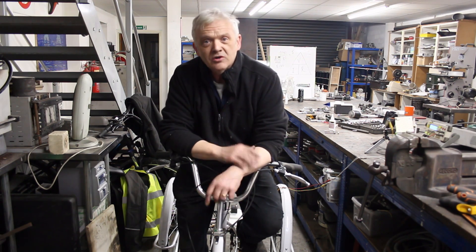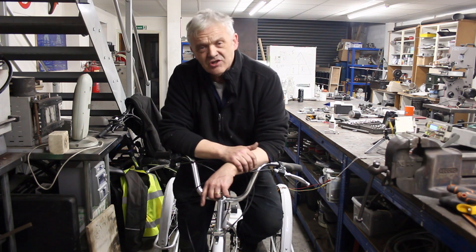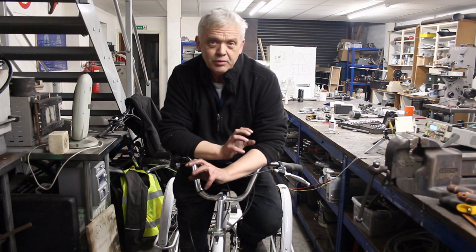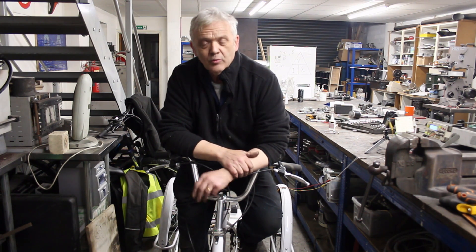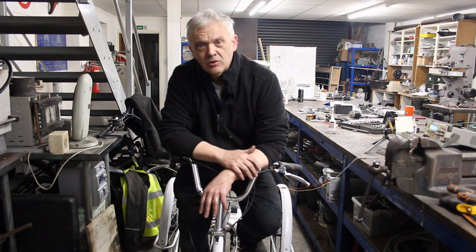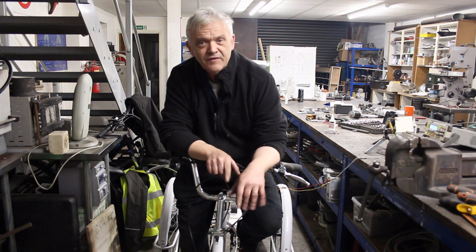You don't have to damage the bicycle to do it. We set it on a frame, put in an auxiliary chain, attached that to a gearbox and motor, and just lashed those onto the bicycle. Put in the effort, pedal away until you've got what you want, then remove everything and you've got a perfectly normal working cycle. You could use the same principle as a dynamo on the tire, but that won't give as good a result — using the gearing here translates our leg torque into motor speed, and generation is a function of speed, number of turns of wire, and strength of magnetic field.